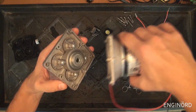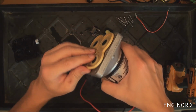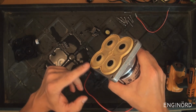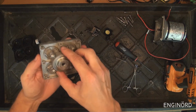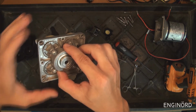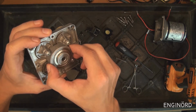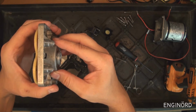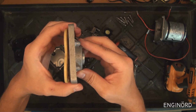So this is placed on the motor, so when the motor is turning, it's going to move these sections in and out continuously. And that basically creates the pumping action. You can see this housing here is stationary, and this housing can move and wobble, but it's pretty much captured. So when the shaft is turning, it's moving in and out like that.